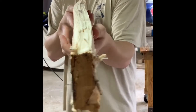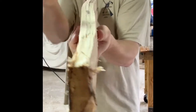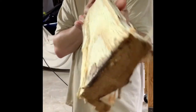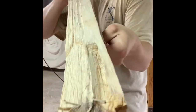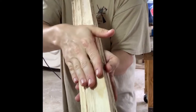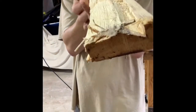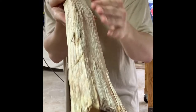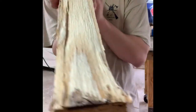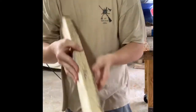A little more squared off now, it's got this wicked bow. But that's because it's natural oak - it got cut down like a month ago. That one's got a big kahuna wave in it, that side not so much. So I think what I'm going to do is use my joiner and take that side down as flat as I can get it. Then this side, well, we'll see - might use a joiner, might use a planer, I'm not sure. This is an experiment, we're going as we go. I've never processed basically firewood into something nice. So next up is the joiner.